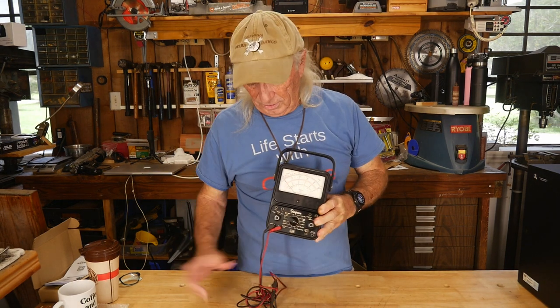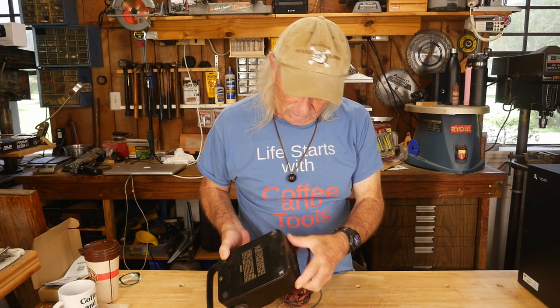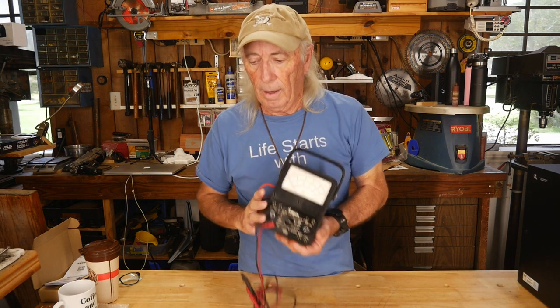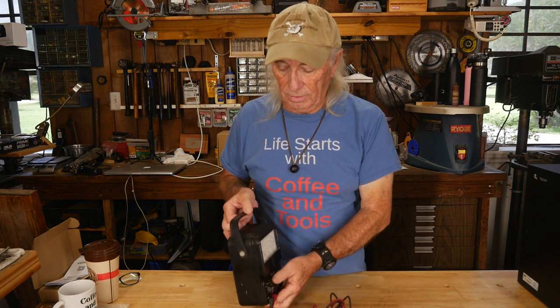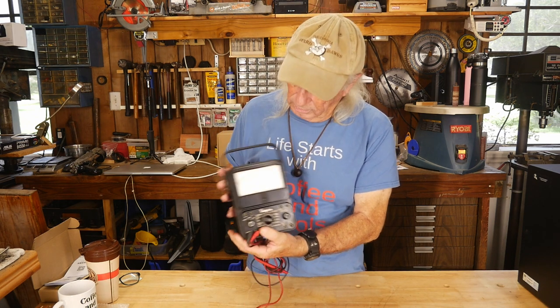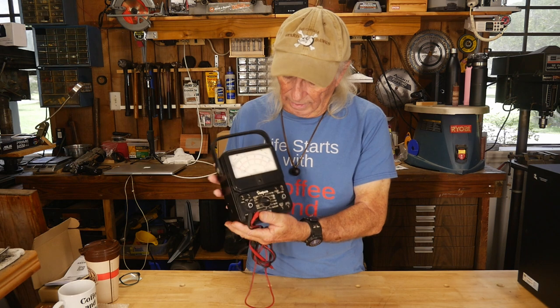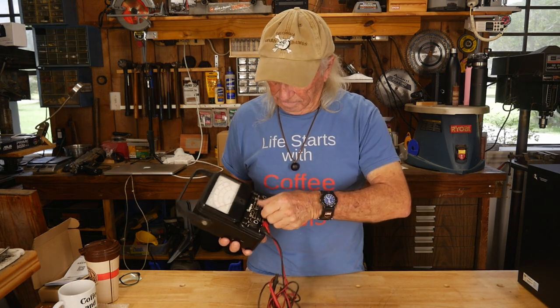I already have some parts here because I'm going to do a repair on it. The first thing to look at is the casing — check for any cracks. When you're at an estate sale or yard sale and thinking about buying something like this, pick it up and keep it in your hands until you're a hundred percent sure, because if you set it down someone else will grab it. The first thing I noticed was the needle is nicely floating — I can see it gently flopping back and forth, which indicates everything is still working. The selector also doesn't feel grindy — it has a nice sharp snap to select the different modes.